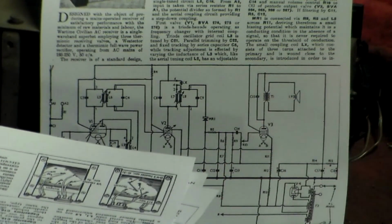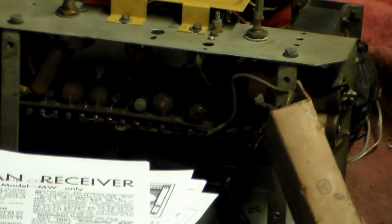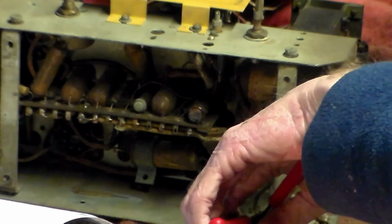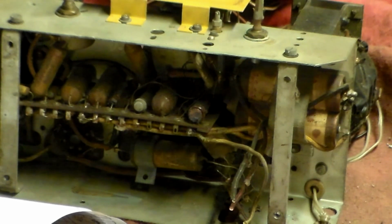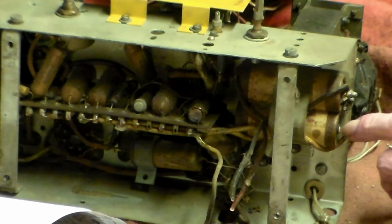This on-off switch is not on the back of these. I've got a switch to go on there. That's not a problem. So that's how the thing basically works. Now another thing, these capacitors, don't leave them in. Do not leave them in under any circumstances, because if you do, they tend to go bang. So remove. Okay. So there's only one real place for these capacitors, and it's file 13.